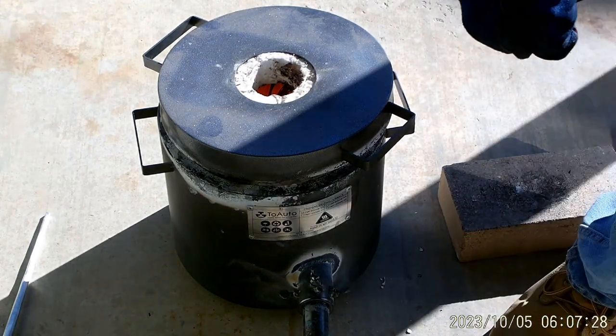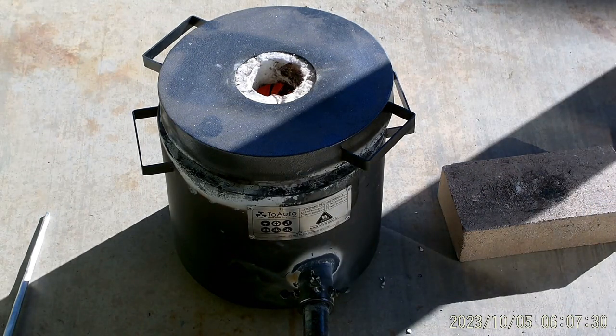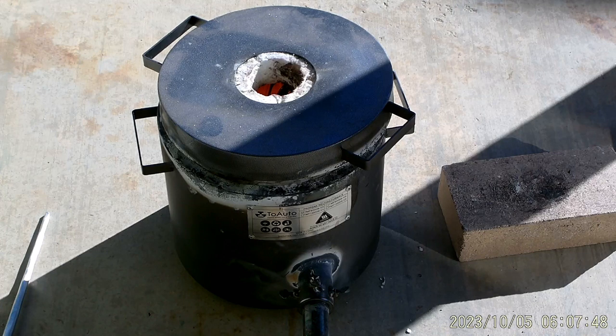Okay, we'll let that sit for just a little bit. That one piece is a little bit high so my lid is not tight, but it's getting a lot more air so it ought to heat up really quick. I've got about one pound two ounces in there. That lid will start settling, and when it settles I'll put some borax in it and stir to try to get the dross out.